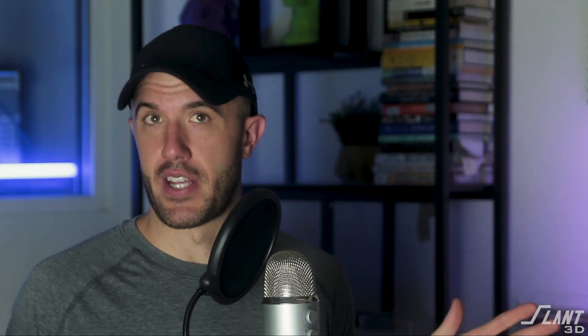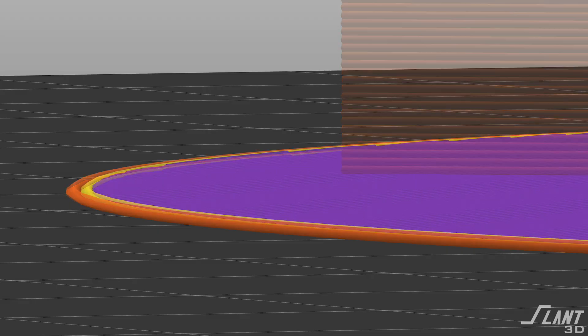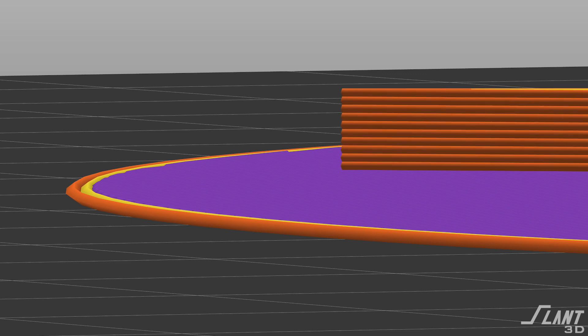But you can catch all of those in CAD. So this is why we want to talk about brims in detail. If you're designing a brim inside of CAD, the first rule is make it 0.2 millimeters thick. This is a nice generic catch-all. You can make it up to 0.3 too — that's okay, it'll still appear inside the slicer — but 0.2 is a good catch-all and you can know it's thin enough.